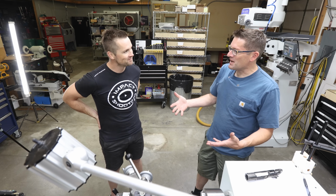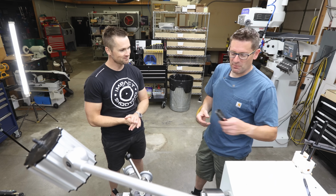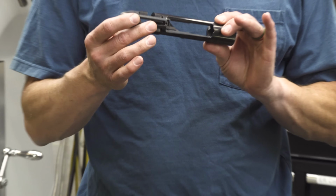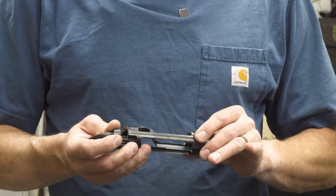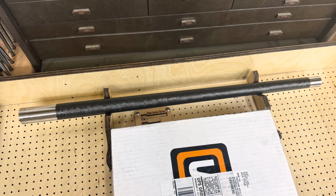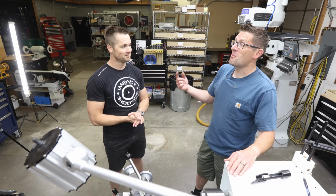We're going to chamber a rifle together. Yeah. We got some cool new stuff to play with. This is Stiller's new Wombat action, skeletonized, lightweight. We've got a Magnum bolt for this. We've got a carbon 6 barrel, and we're chambering up a 6.5 Sherman short, which now we both have experience with.